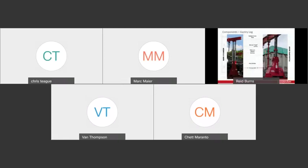And then you've got the housing unit, and that's where you've got the main guts of the leg. That's where the hydraulic motors that drive the cylinder are. That's where you've got your valving, your hydraulic plumbing for the unit. There's also compartments to keep different accessories that are useful, like the collar that pins off the dead section. Most of the time, that's where you're able to keep different pieces that you'll need to use in the field. So if you can't find it, chances are it's in the housing unit, along with, like at other sites, water bottles and other trash that shouldn't be in there. And then finally, at the base of it, you've got your wheel assemblies. It's pretty obvious. This is what interfaces with your track and what propels the unit down the line.